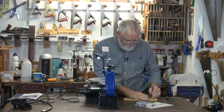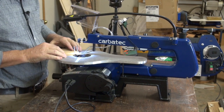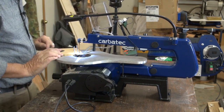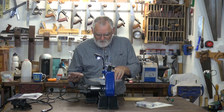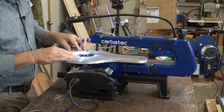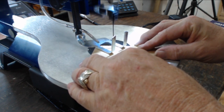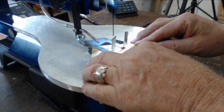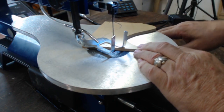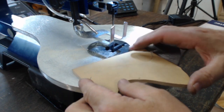Same as before — draw a quick pattern, bring the tool rest down to the job. Have that guard down, but for the sake of this demonstration I'll have it up. Then you're ready to cut. Turn the machine on, present the material to the blade, and slowly move forward. Turn off the machine, raise the workpiece hold-fast — and there's another cut.